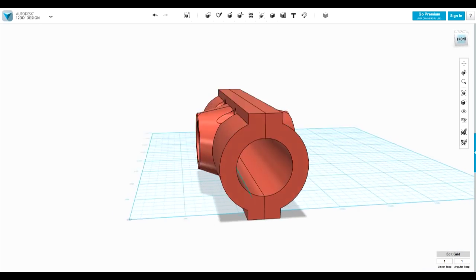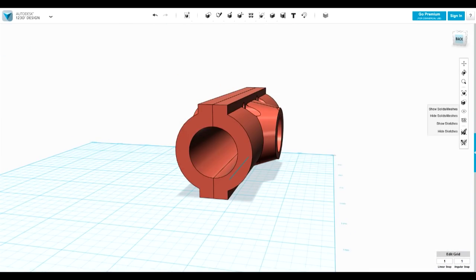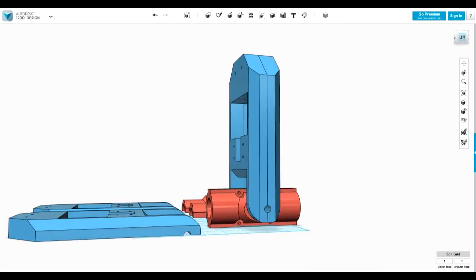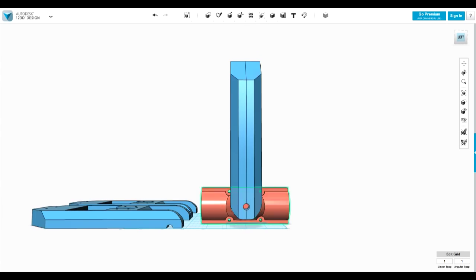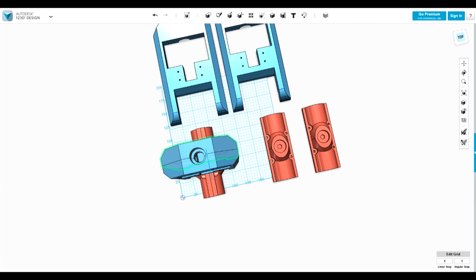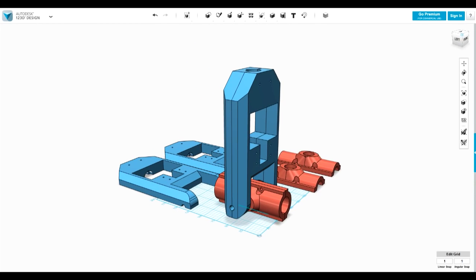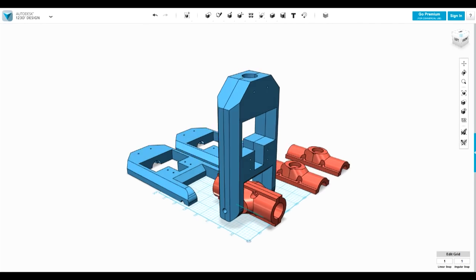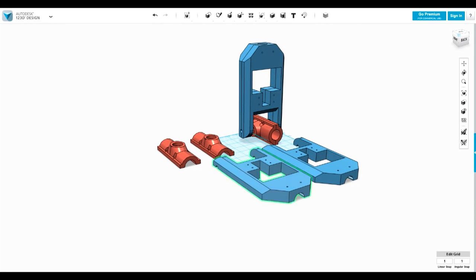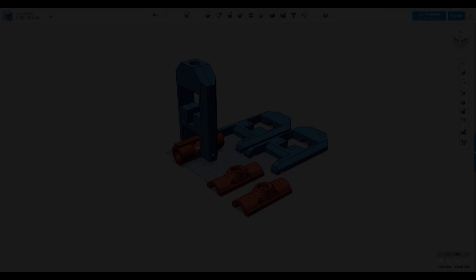So that should be able to be tightened around that aluminium tube I've got to get the right tension so it can move sideways. Then of course the other piece will rotate the other way, so that's got bolt holes that go in the ends. The servo fits in the middle that turns the head, and again we've got bearings in the top and bottom of the top part. So then of course that can move in all directions, which gives me my 3-axis, and I've laid all the parts out you can see around here for printing. They're all printed in 2 halves, so they're flat on the bed, and I can stick them back to back to get rid of any warp.